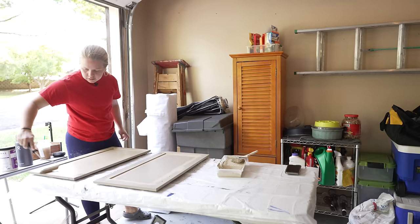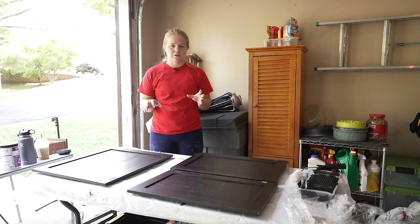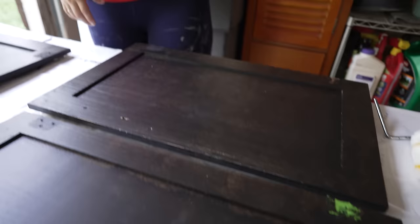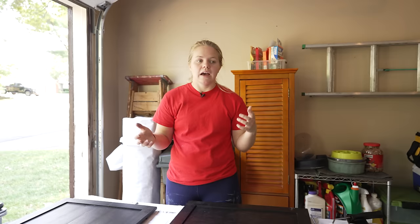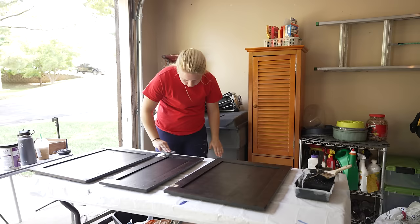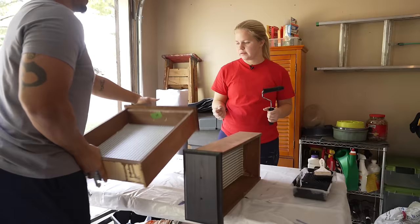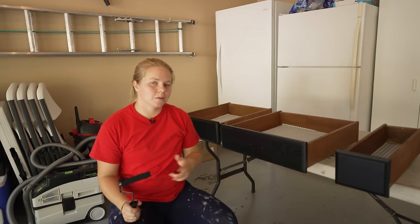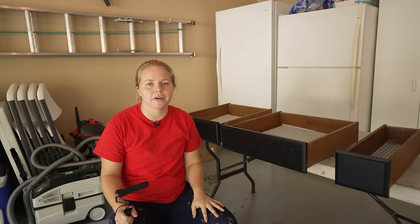Just finished up with the linen. Now we're onto the second coat on the insides of the cabinets for the black. I did notice that yesterday we probably flipped over the black a little bit too soon — there were some fuzzies on there, meaning that it stuck to the drop cloth a little bit, but you can't see them anymore because I already took those off. Since this is the second coat, I want to be really careful and not flip them over too soon so nothing sticks. I also went ahead and did the second coat on the drawer fronts so that those will be ready quicker.